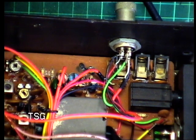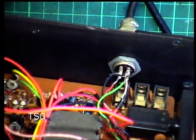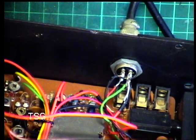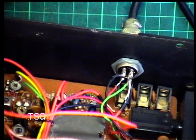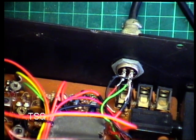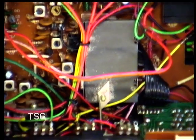A lot of people will think that the Cybernet type of wiring on a 4-pin plug is standard, in inverted commas. But when somebody else buys a radio like this off them, it can become quite a problem when it's been wired something else. And I really think that people who want all the mics to fit all the rigs they've got really ought to make themselves some crossover cables or some little boxes with a socket on and a flying lead, rather than actually change the wiring in the radio.